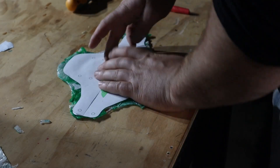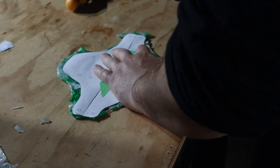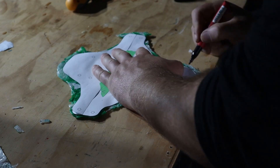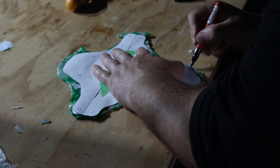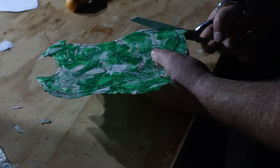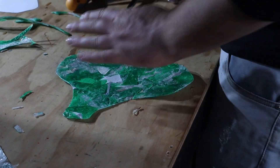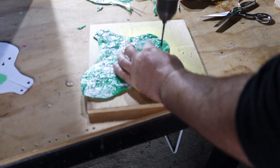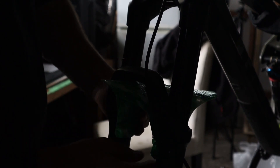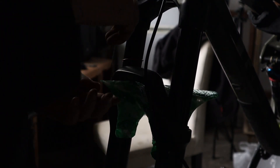Once you have your sheet, there are many options. For mudguards, you could just eyeball it with a pair of scissors, or Google DIY mudguard templates — there are about a million of them. I'll leave the two I made down below, just below the donate button. LDPE cuts really nicely with sharp scissors or a craft knife, and you can drill the holes out with a 5mm drill — it works perfectly.